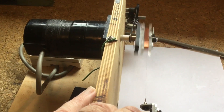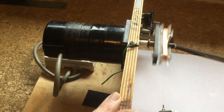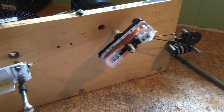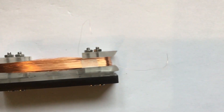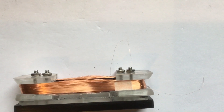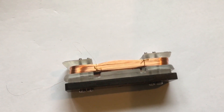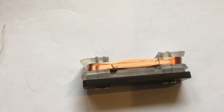The only thing we've got as a constant is the amount of tension placed on the wire before it hits the bobbin. That's 5,400 turns — the counter shows 540, with another zero from the 10-to-1 ratio it runs at. I've put a little piece of tape to hold the output end in place, and the looped piece is the inner piece. I'm just using ordinary cotton, tied off — not particularly tight, because the next phase will be masking tape. This is just to hold it together when I remove it from the bobbin.